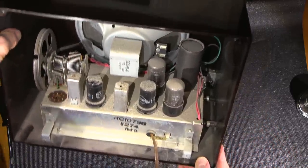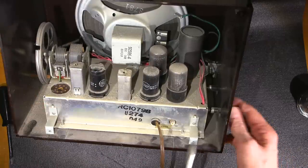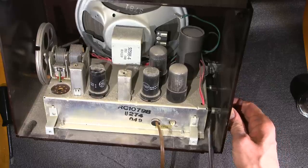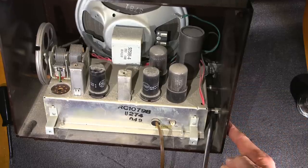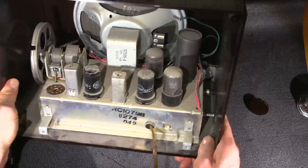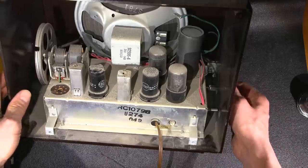It's a little easier to see on this side. Put that there. That should hold that up. Give this just a bit of a twist, just like so. Last thing you want to do is pry between the case and the knob, because if you do that, a lot of the times you'll break the knob. You can see how thin this material is. Be a good chance that that would break.